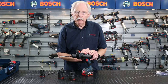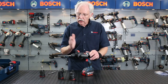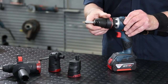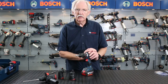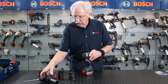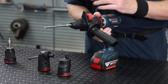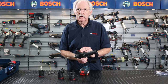Once your drilling applications are done and you want to go back to screwdriving, you don't need to remove the drill bit — just remove the whole attachment, put your chuck on with your screwdriver bit already mounted and you're ready to go, saving time. Then just switch back to your SDS attachment — you might need to readjust the handle slightly, but that takes two seconds.